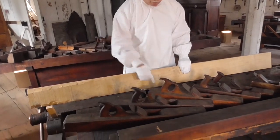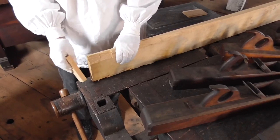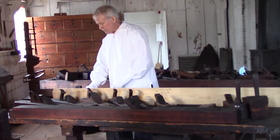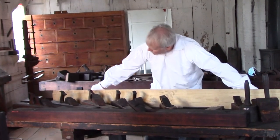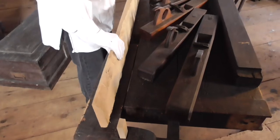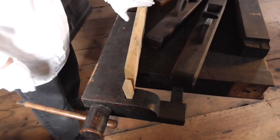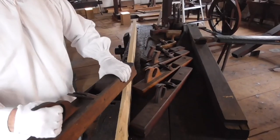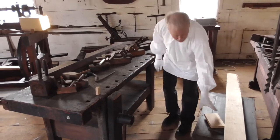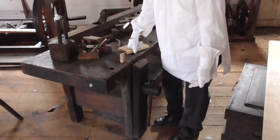And now here's an oddity — this part doesn't have a hole here, and I have a feeling it's just because there'd be too much stress. So the board actually on this one: if you were this length here and shorter, you could put a plane and you'd have the board perfectly straight in the bench. But here, you're back from that angle just because of not wanting to break the device. If you put this in here like this, you would take your planes and at some point use a big plane to get it nice and straight. So this is a tail vise. If you're working with something shorter, you would be working with a vise like this.